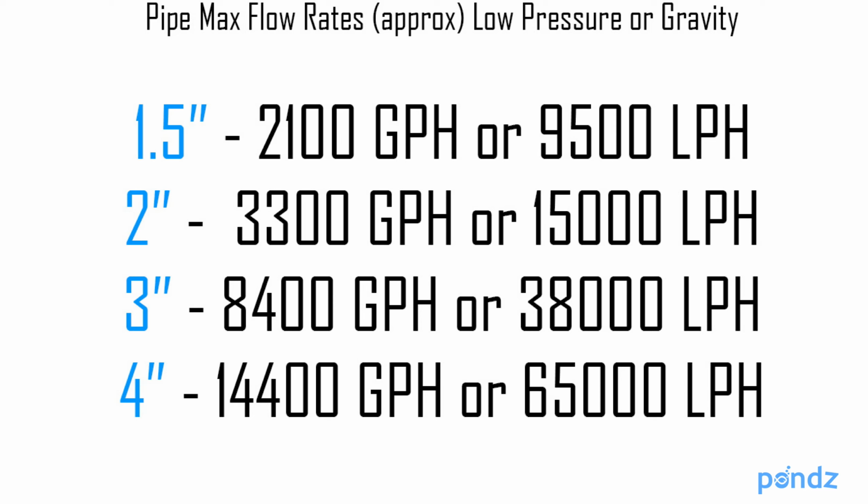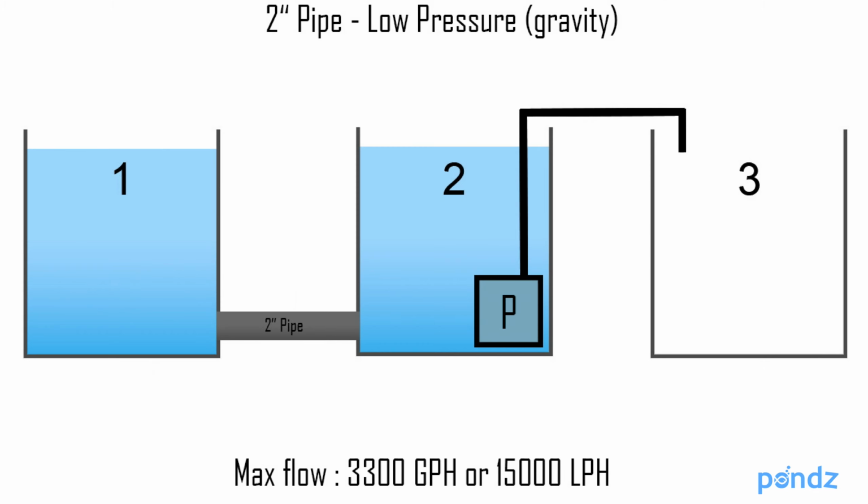And then if you think about it even more, if you did, you wouldn't just have one bottom drain, would you? Most people who have had a pond that big or needed a pump that pumped over 65,000 litres an hour probably have 4 or 5 bottom drains on it already. So you've already reduced the flow rate on each bottom drain by 4.